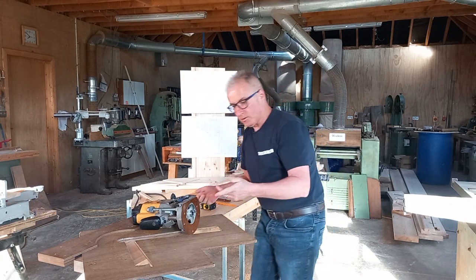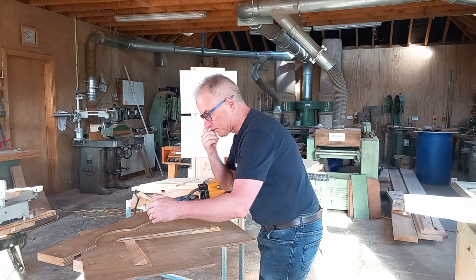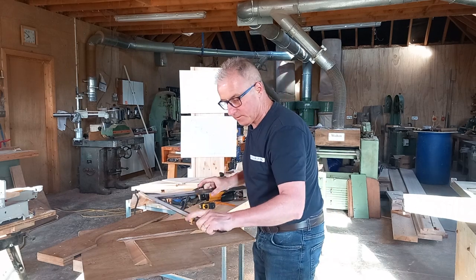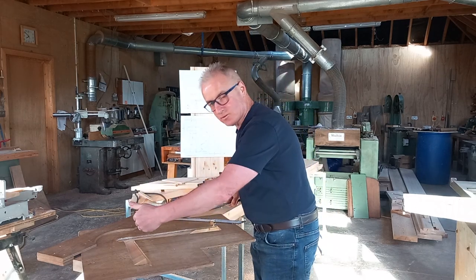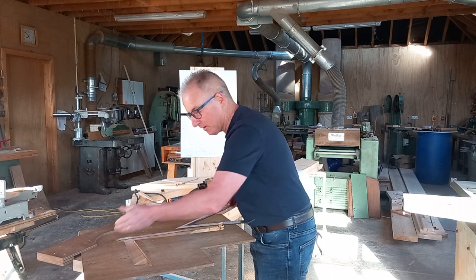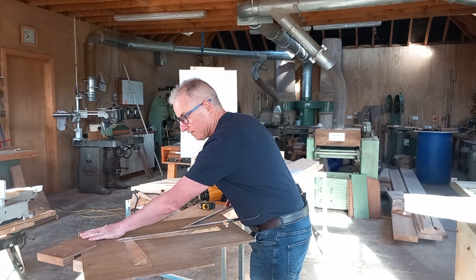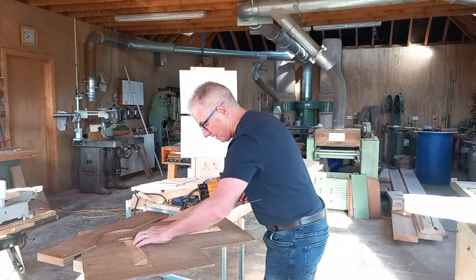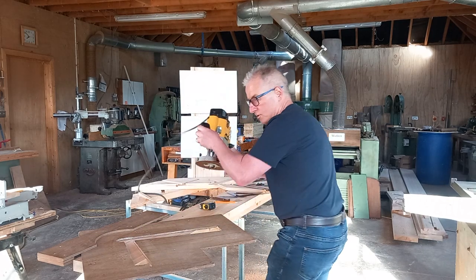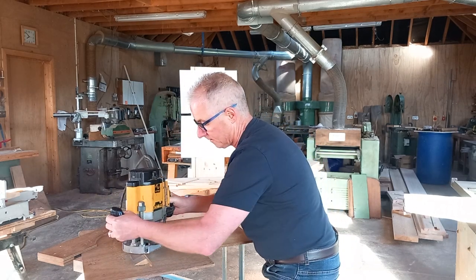So just to show you the process, that's the marking out, that's the setting out. Once you've transferred your information onto your builder square with the gauges, marked it as I've shown you, and then you apply the template to the marks plus 8.5 forward and 8.5 above on the rising string. Put your fence in position and screw it on, and then you can clamp each one as you go to route. So the route motion we'll be showing you will be just forward around like so and like so.